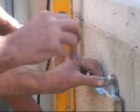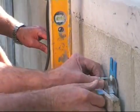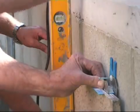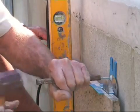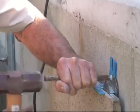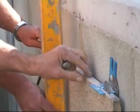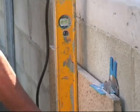If you have to affect a joint that is smaller than the StoneClip shaft or thickness, which means you have to cut out some of the underside of the top panel, this is the only joint that is to be rebuilt with epoxy resin or such like, and it becomes a solid fixing, meaning that there's no movement at all.